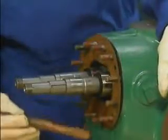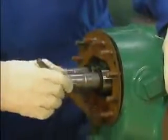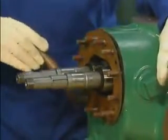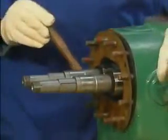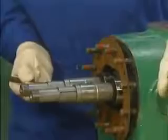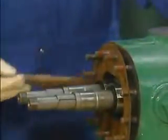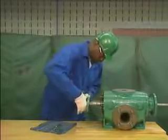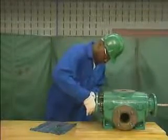The flange bolts are lubricated to prevent the bearing bracket nuts from binding or wearing away by friction as they're turned, to help prevent corrosion, and to make later removal of the bearing bracket nuts easier. Only a lubricant recommended by the manufacturer should be used. The mechanic carefully guides the outboard bearing bracket and its gasket over the flange bolt threads.